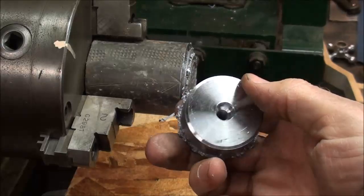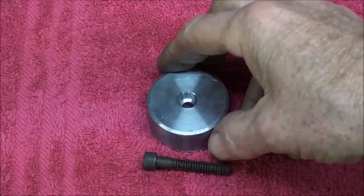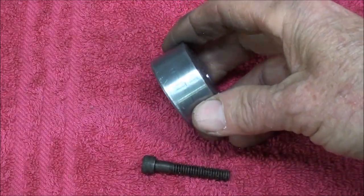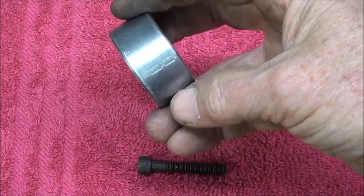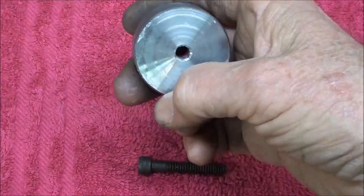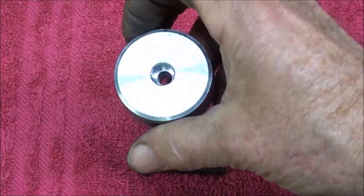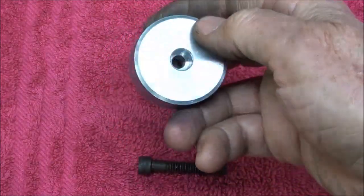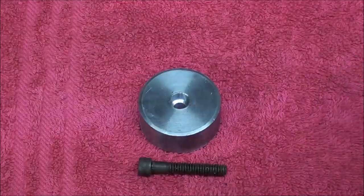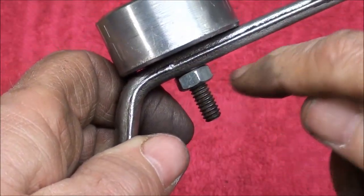Not that it matters because this will soon get beat up, but I want it to look fairly pretty when the job is finished. There it is — it weighs 11 ounces, just weighed it on a postal scale. There's no way of holding this without putting marks on it, so there are the chuck marks which I anticipated. The burrs on the back side are hard to remove without scratching. But it is just a hammer head — I got a bit of a chamfer on there, and it will be really beat up after just several uses. It is now bolted on, and my last step is to saw or grind the cap screw off flush.